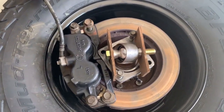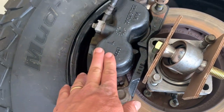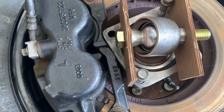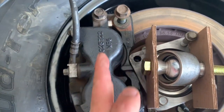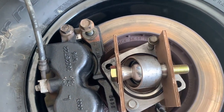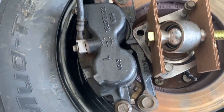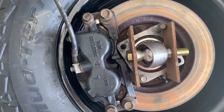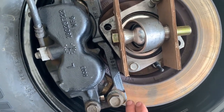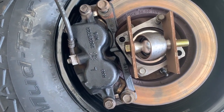It is tough to design things without having all the parts, so I finally have the parts together. I have the spacer that I made off of the old spindle, the brakes cleaned up, and I mocked up a simple bracket that will hold the uniball at the other side. My original plan was to run the brake totally vertical and also rotate this such that the bolts were going to be split in between the quarter-inch plates of the spindle. But as you can see, there will be some interference by the mounting bracket of the brake. So I'm having to offset a little bit. I can still get the same plan I wanted with the uniball in the middle — I just have to orient it slightly different so this quarter-inch plate will just clear the bottom of that bracket.